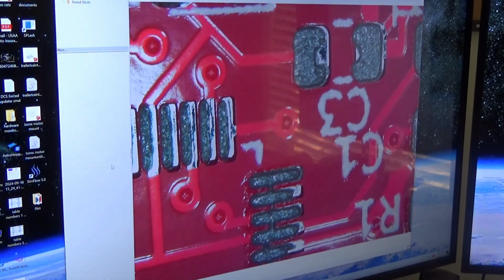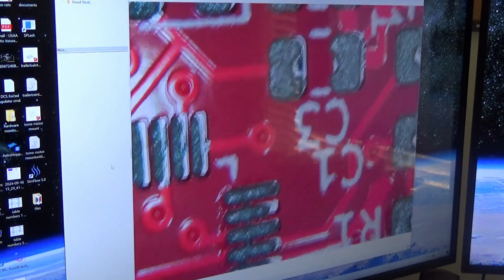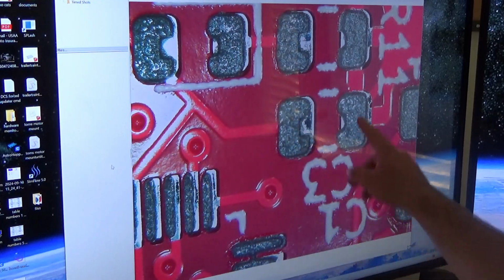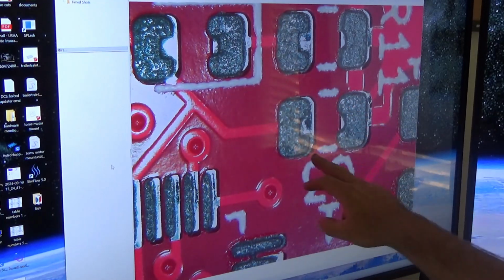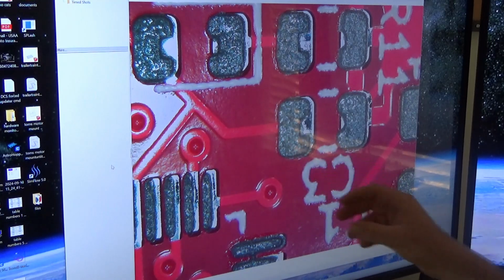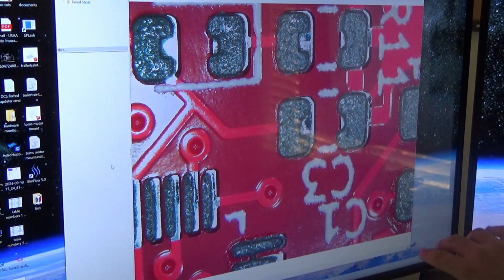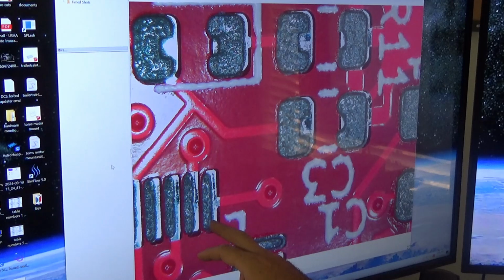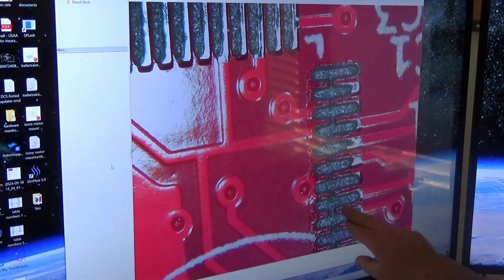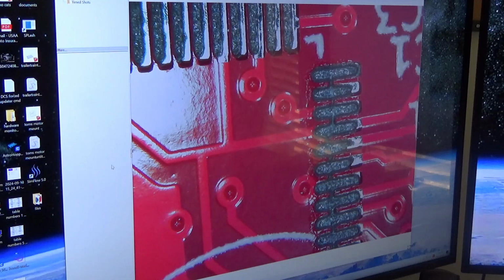And mainly I'm just concerned about that chip, because all of my other components compared to the chip, as you can see here, resistors, they're very big spaces between them, whereas the chip actually has very small spaces. So these components, the solder will kind of wick to either side, and it'll actually separate on its own, whereas the IC chip here, the pins are so close together, this extra solder here may actually make a joint that we'll have to come back later and separate.